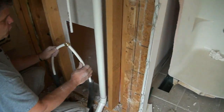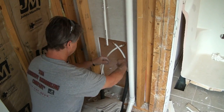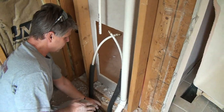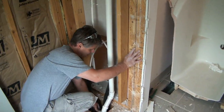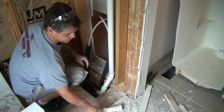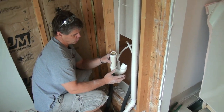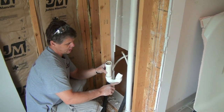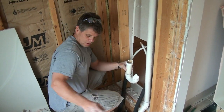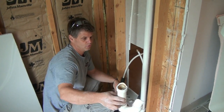Here are the two pipes that we capped over here in the closet — we had to get these cut to get the tub out, so we can see all that now. There's going to be a new trap going down on the floor here, which is going to come up with a new tub, and we'll be doing all that plumbing down in this hole in the floor where the trap goes down and comes back up. What the trap does essentially is it fills with water — water always lays in the trap — and sewage gas can't back up because it cannot go through water. The water acts as a barrier to keep the vapor from coming out of your tub drain. That's what a trap does — they stop sewage gas.